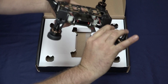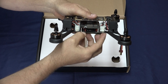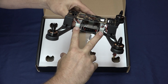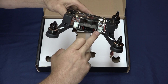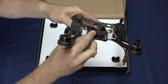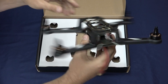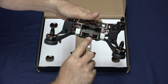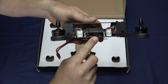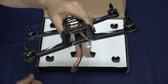The bottom plate is your power distribution board, which makes things a lot easier to plug in and replace. You have your motor plug-ins here which go to your ESC and motor on both sides. This plug right here is your satellite, or DSM-2 satellite plug. On the other side we have the flight controller, and through this black pad here are the plugs for the flight controller. In the back we have the DSM-2 compatible satellite.